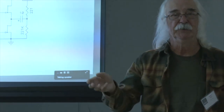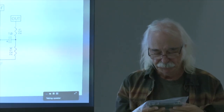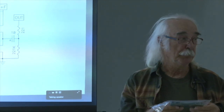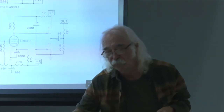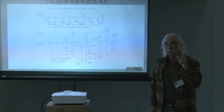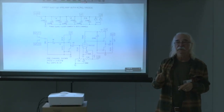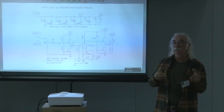The article was on DIY audio previously, and the Korg, however, looks like a little computer chip in its own glass. And if you look in there very carefully, you go, what the hell is all that stuff? There are a pair of tubes in there. They're not very powerful tubes. They are strictly there to amplify low-level signals into somewhat higher-level signals, but with a generous dollop of that second harmonic, negative phase second harmonic that I was talking about. They are literally triodes. They're literally triodes that have a really odd way of heating a cathode, but after that they are your classic triode pieces.